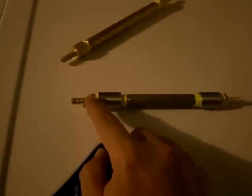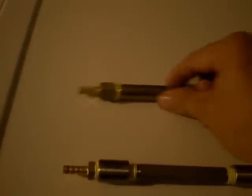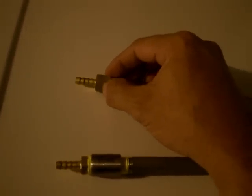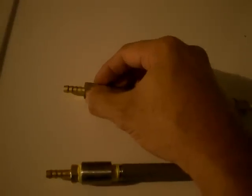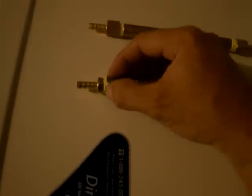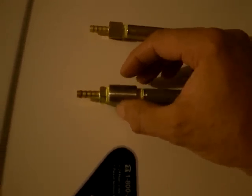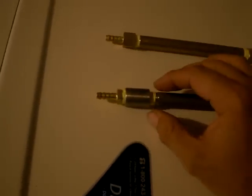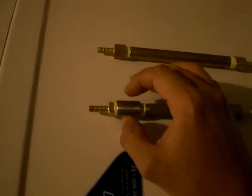The problem is, you can't have any kind of air pockets in here at all. When you go to put on your fittings on the end — like these ones right here — these are probably the better design because the brass wool comes out to the end of the threads and you only have a little space right in here. But what you really want to do is fill up all of the free space with the brass wool, so there's no place for the fire to occupy and stay burning.